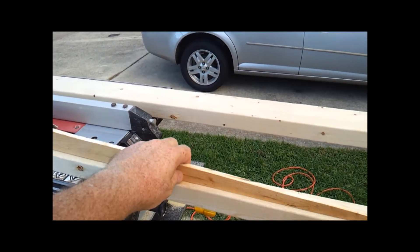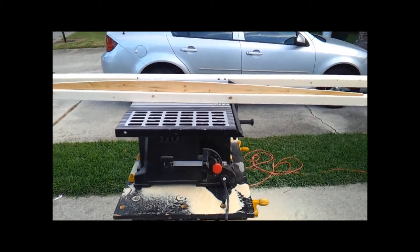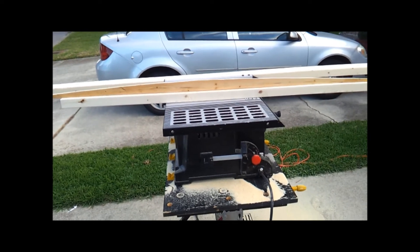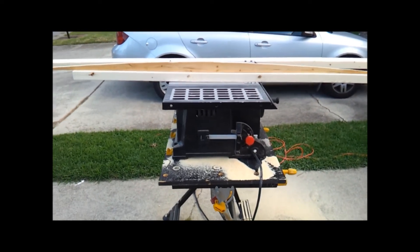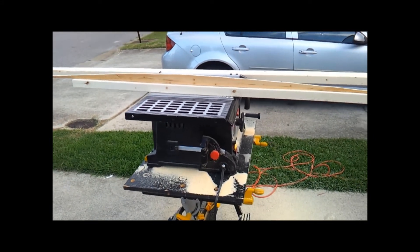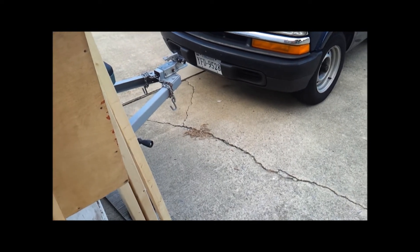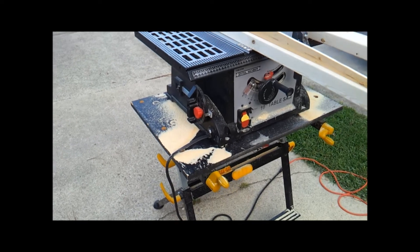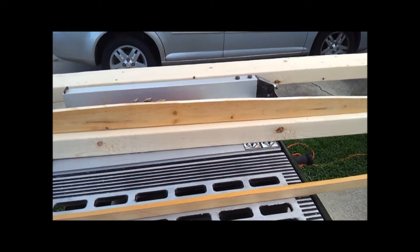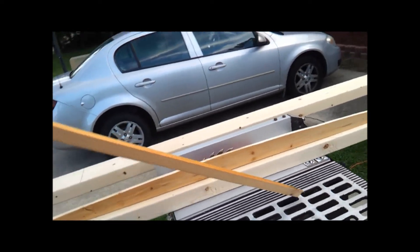By doing this, I basically took a piece of wood to use as a pattern. I looked around for something that would give me the proper bend, a nice easy bend, to put on the piece of wood after I marked it to use as a pattern, so each one of my pieces of stud will have the proper and the same arc — all uniform. What I found was I could take a piece of scrap board, attach it to a piece of wood in my multi-use workmate, and bend it, holding constant pressure. When you bend it, it does have a bow type shape to it, nice and consistent. I used that as my straight line and I made my pattern.